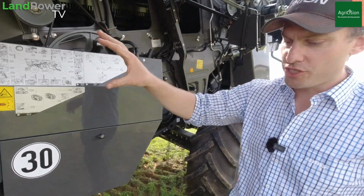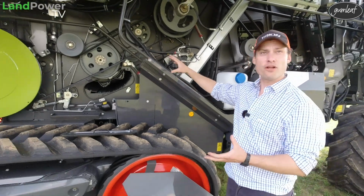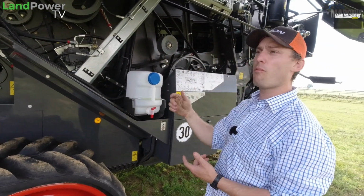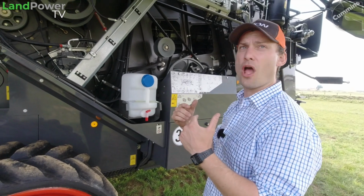As for the walker machines, we've got the same principle at the front. So threshing drum at the front, APS, threshing drum, and then impeller. But then instead of the rotor system, we have the straw walker. And they're a 4.4 meter long open walker design that we previously have known.